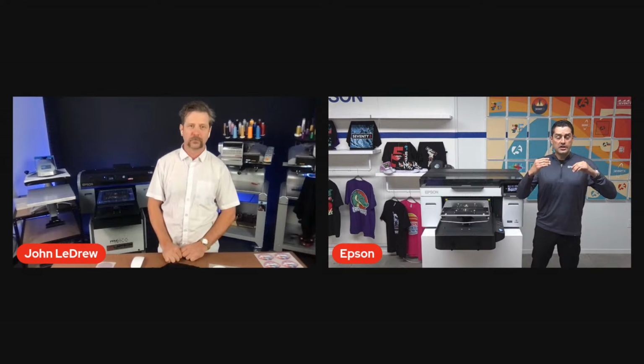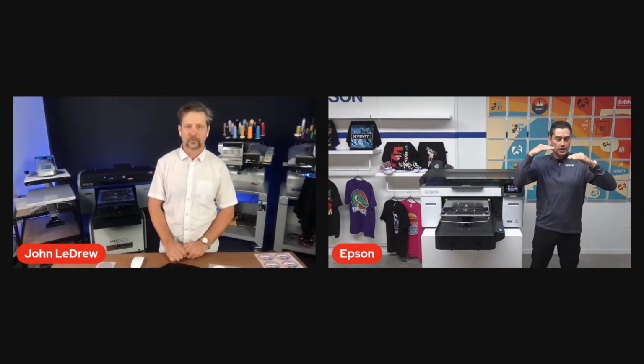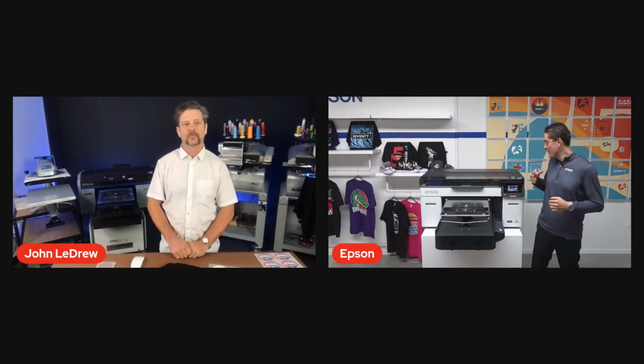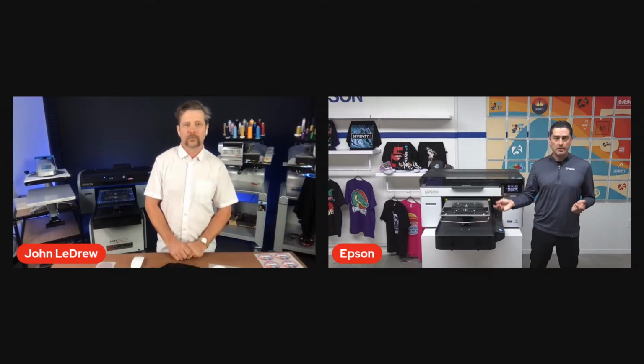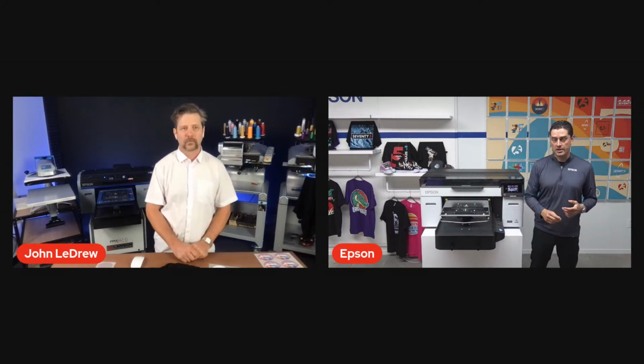So those sensors actually have a 3 millimeter range on the platen, and they will detect whatever is loaded on the platen as it goes in. Now the platen itself doesn't raise up or down on its own. The printhead inside the carriage is what actually will adjust to the appropriate platen gap, whether we're printing on a shirt or reload a piece of film. So in other words, you do not have to manually make adjustments to the platen by raising or lowering it when you're switching from one garment to the next.